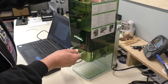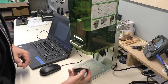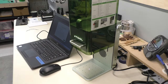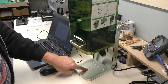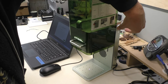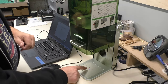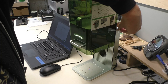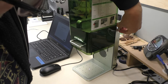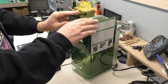Here's something other people talk about — there's actually a lens cover on the unit. You've got to take that off. Now we can see the blue light as well as the red light. If you drop the unit down, you'll see them converge — and when they converge, that means it's focused. Spread them apart and they're split; bring it down and they converge. That's the focusing mechanism.